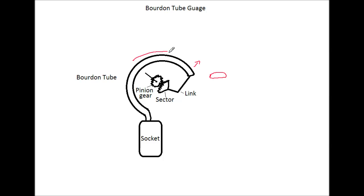To redraw the tube, it would end up moving up. So that tube, instead of a C-shape, would start to straighten out. When that copper tube straightens out under more pressure, it's attached to this mechanical link here, and this causes a displacement.